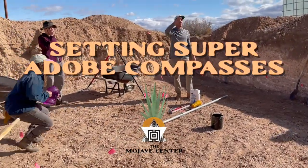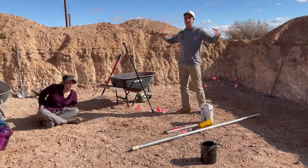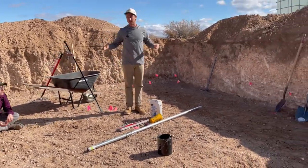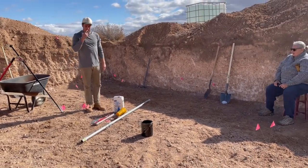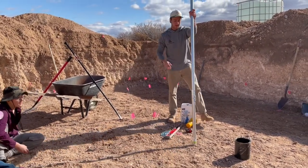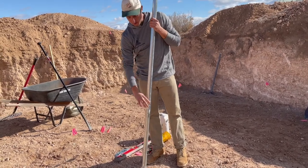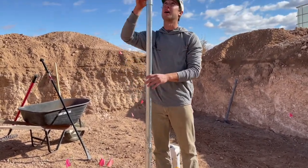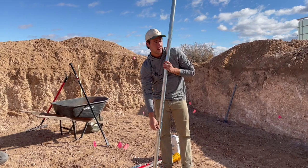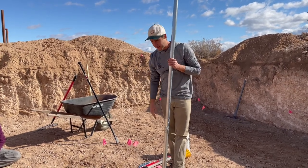This is going to move up with every ring instead of having it spring from the ground. With a larger dome like this, you could potentially have a flag in the chain — if you pull it, it'll stretch. Using something like this is really easy and just makes your life a lot easier. All it really is is these two little couplings: one is our pivot point as we reach higher elevation, and the other secures it in position. With every couple of rows, we unfasten it, move it up level with the next course, and adjust it according to the height compass.